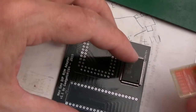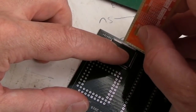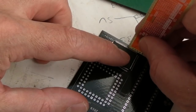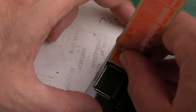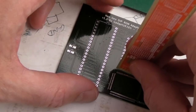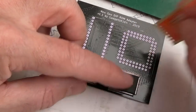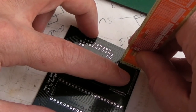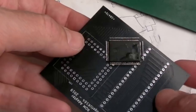We know all the solder is off on the underside. So at this stage, what I would probably do is just hold it down like this and get on the very edge of the pins and just press down gently. Not hard, just gently. You're just making sure that it's as flat as it can be before you apply it onto the board. But a hard surface is really important, and obviously something hard to push these pins down. Other people will probably just throw it straight on and not worry too much, but then you'll get bumpy solder. If you get it nice and flat like that, trust me, that is really super flat now.